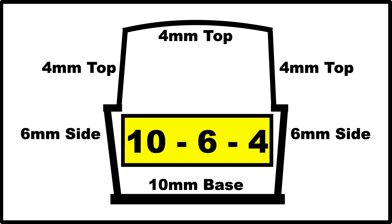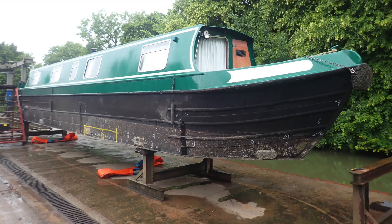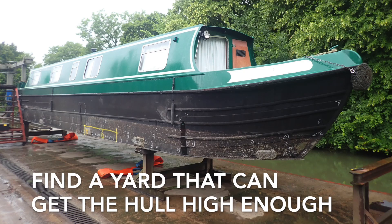Given all that we've considered here, there are three things that still stand true. If you want to prolong the life of any steel hull: build it with good quality steel as thick as the design would allow; fit anodes at the right scaling and composition; and use the best paint you can afford inside and out, and keep it painted — including the bottom plate. Not doing all three means thickness loss is inevitable. Thanks for watching, I'll see you all next time.